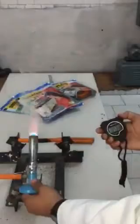Now the test is completed. You can see that the specimen has not caught fire and the crack with the fire within the marks was within 50 mm. This is the burning behavior test for the hotline LPG hose specimen, and this test is most important for any kind of LPG hose as per the safety criteria of the customer.